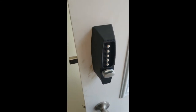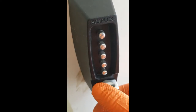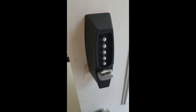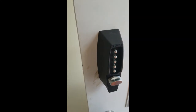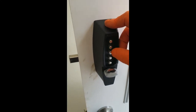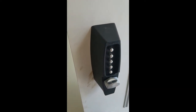To fully reset the lock, you're going to go back outside. You're going to turn it counterclockwise — counterclockwise is always lock on these. You're going to hear everything clear out. Now you're going to dial your new number. Let's say, hypothetically, you want one, three, five. You dial that number, then go clockwise. Now you have to lock the lock — always left. Check your number before you close the door: one, three, five. Clockwise to unlock. And there you go.